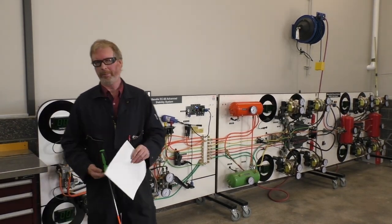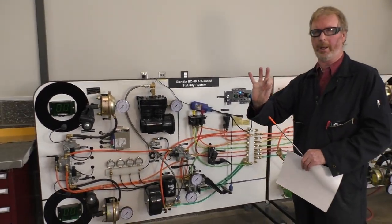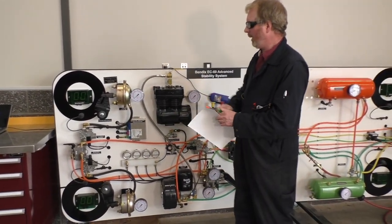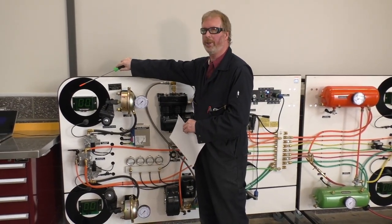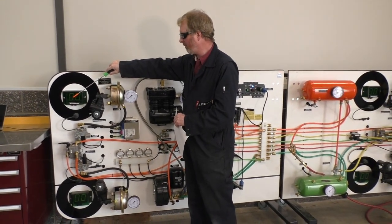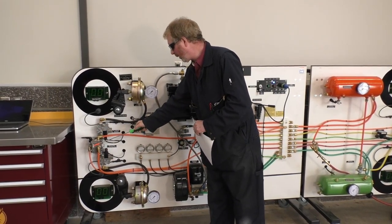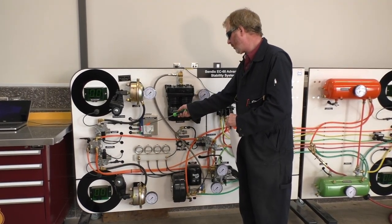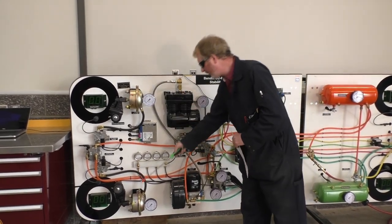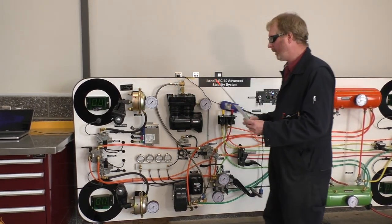So for introduction, this section here, this is three different boards, okay? So the section here down is basically, here's my engine. These black circles represent the steer tires. You'll see these are my wheel speed sensors. I have a couple of modulators, and I have a quick release valve right here. Here is my controller. Air compressor, dryer, and a couple of front steer air cans. And these are a type 24 air can, same as what was on our steer tires, okay?